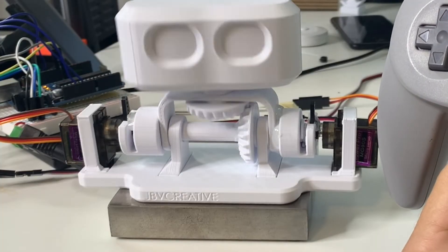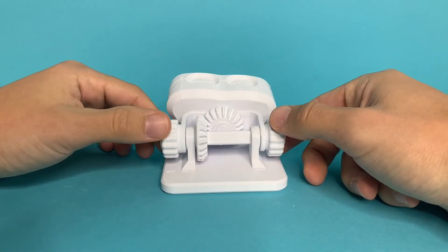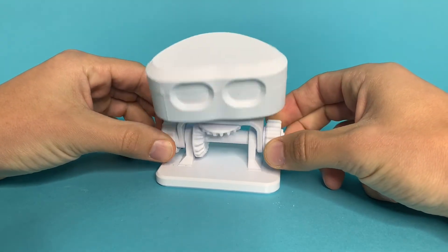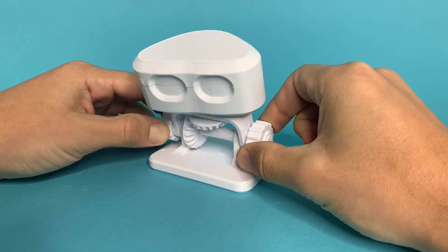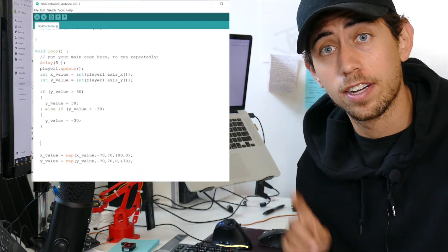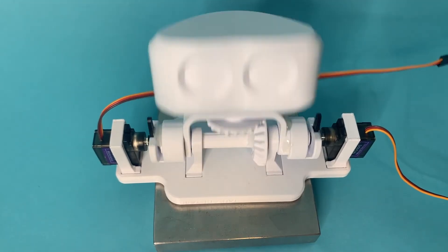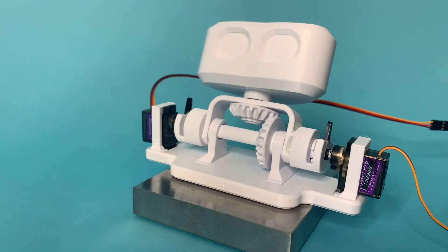But wait, there seems to be a small flaw in the design — as the head tilts it creates a rotation as well. To solve this, remember from the mechanical version that we needed both knobs to move together to get the head to tilt. This means that any rotation of the head will be a function of the tilt angle plus or minus the rotation angle. This sounds complicated but it actually requires just one extra line of code to make it work. Now you can see that when we tilt the head forwards and backwards without rotation, the servo motors are moving in sync with each other.